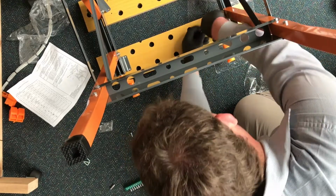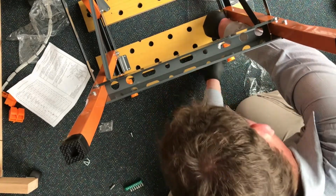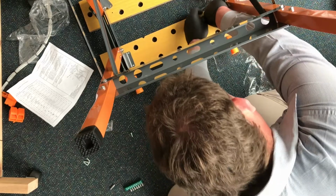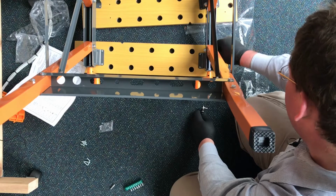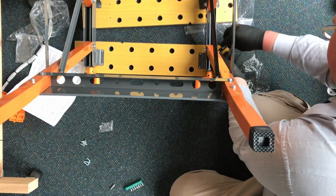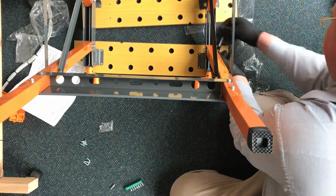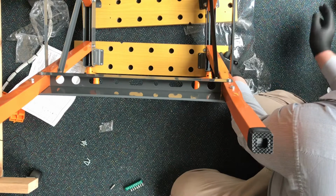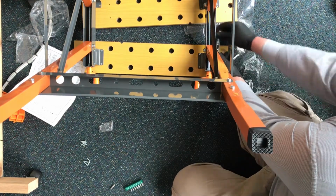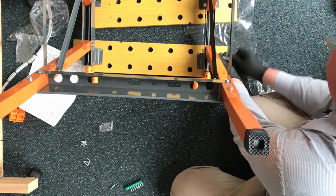Yeah, now I think about it, I probably won't be able to get this same sort of laminated surface finish, but what I would still love to get is those measurements on the top, or at least my own. Because having rulers everywhere, especially when you're, well, I don't know. I'll find out. Doing a toner transfer though is more interesting. So I've got a couple of laser printers, and if you know about laser printing, then you'd know that the laser printers themselves use plastic instead of ink, the stuff that it prints on, and that's easily transferable if you heat it up.